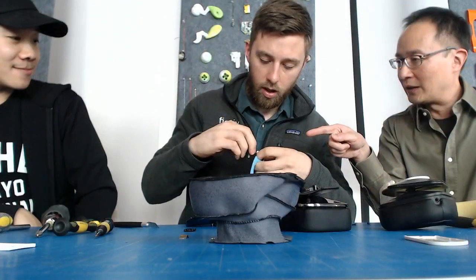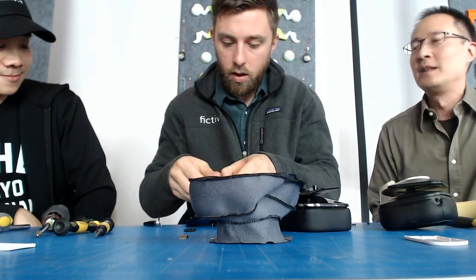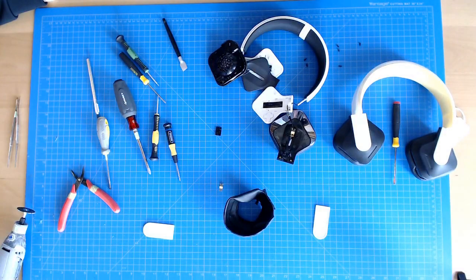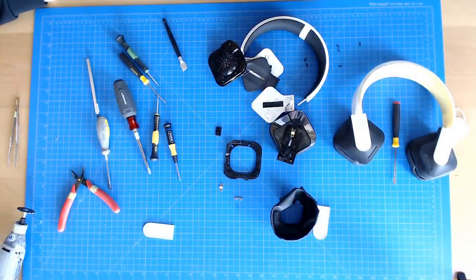Yeah, and we'll see once you get into the band, then you realize it's also a combination of how much flex the band has. So I think this is really interesting. Is this just glued on here? It looks like it. Right, but there's several layers of other materials to support the foam, and then glued together. If you're going to tear it apart, you really have to get down. So injection molded, probably a PC or an ABS or something. I believe most of the parts are ABS, except for one of them where there's high wear, so that's a glass-filled nylon.